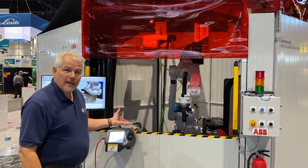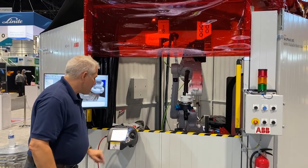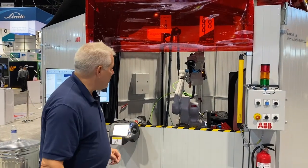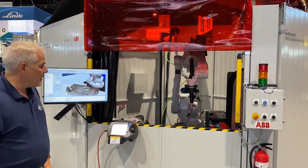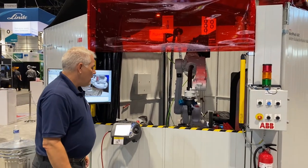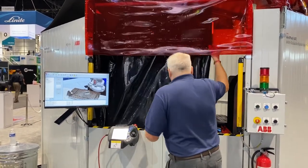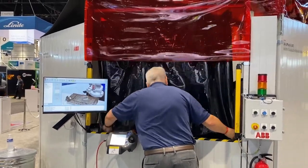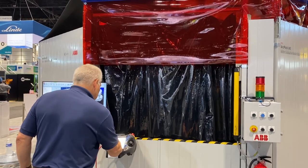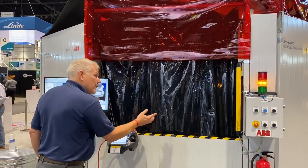Now the robot's going in and finding the second point that I taught, and it'll put the wire right in the corner there. That's good. So as a welder, now I've given the robot all the knowledge it needs to be able to do a really good weld. We'll do a little quick run through. And as you can see, the path is exactly in there. It's a great path. And then we'll run it for real. Just choosing that same path again. Pretty welding on. All right.